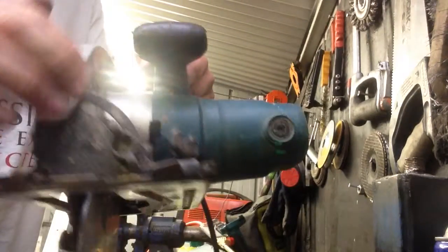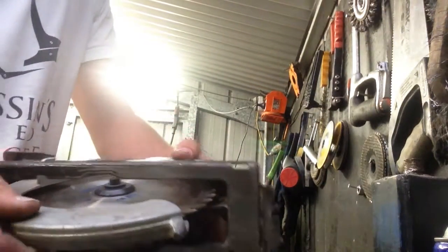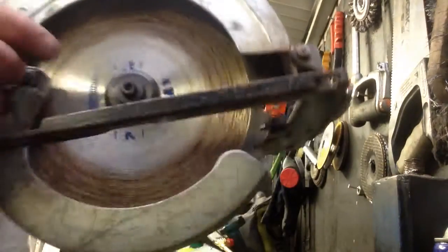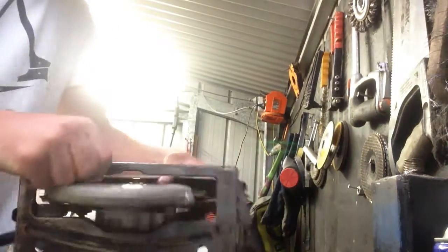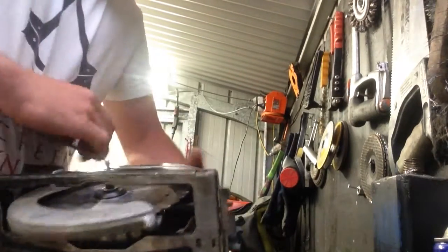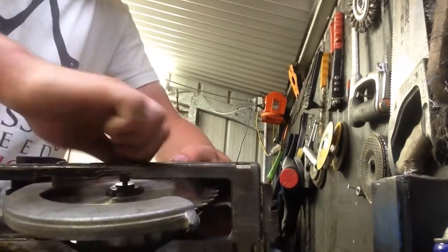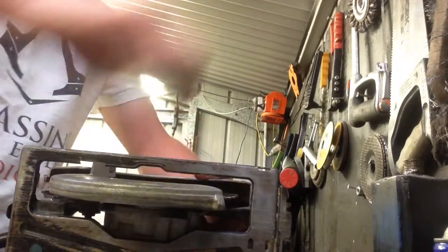First thing to do that, there is a black lever here. This stops the blade from moving, allowing you to loosen or tighten this allen key bolt. As you can see, I've loosened the bolt, and after it's taken out, the saw blade will come right out as well.